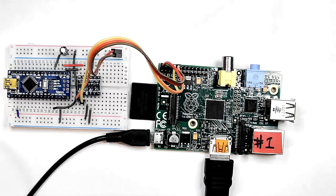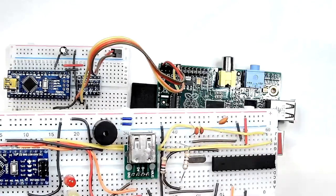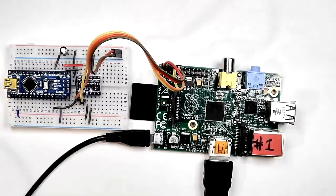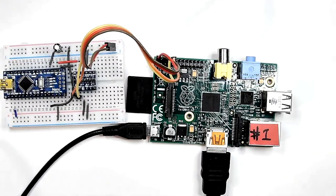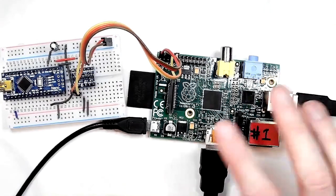One huge advantage of this system is that it doesn't require a PS/2 protocol keyboard. With previous builds, even though we used a USB socket it needed a USB keyboard with PS/2 protocols, and there was no way of knowing which keyboards did or didn't support that — very annoying. I have here a mini KeySonic keyboard that is USB only, so it never worked with the original Tiny Basic system. However it should work here because the Raspberry Pi, as part of the PiGFX terminal, runs a bare-metal USB driver — so you can plug any standard USB keyboard straight into the Pi.